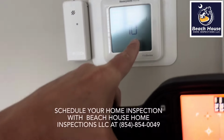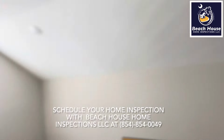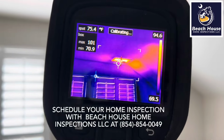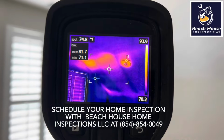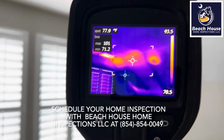Defect number 3, we have a thermostat on the second floor in the off position. We have a thermostat on the first floor that's on the heat position, and we have heat coming out of the second floor supplies. We have one air handler, one air conditioning condenser. We should have proper operating dampers. We do not have proper operating dampers.